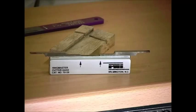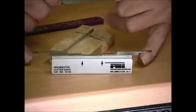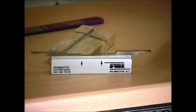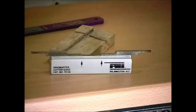It's not absolutely necessary to have. It's four inches overall in length, and these marks are an inch and a half in from each end. So if you wanted to make your own out of a block of wood, it's simply four inches long, an inch and a half in from each end with a one-inch gap in between — that will give you your spacer. The advantage of the magnets is it holds everything together as a unit, so as you move them back and forth, everything moves as a unit. But it's not absolutely necessary; a lot of people choose to make their own.